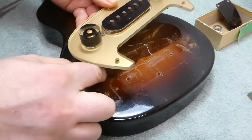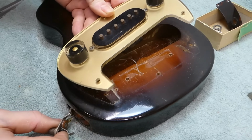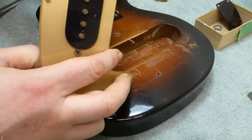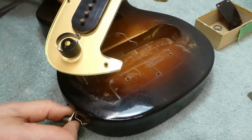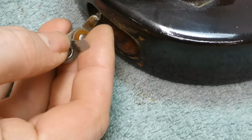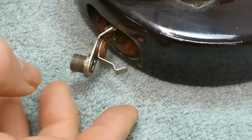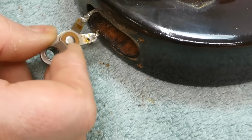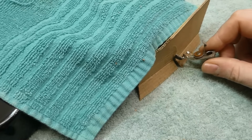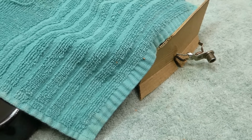Okay, so the jack is actually too large to fit through the hole. It has to be wired from outside. Is there enough slack? No, I don't feel comfortable about that. Yeah, the hole is big enough for the wire, but not the actual body of the jack. And the jack itself is one of these antique designs where you've got the barrel and the spring for the contact on one side and the connection points for the wires on the other. And these wires have been wrapped around the eyelet. So I think I want to suck the solder from them to start off with.